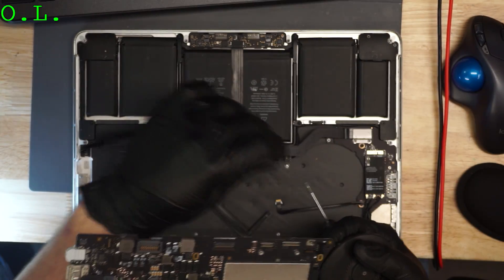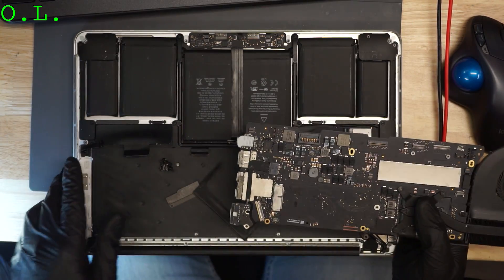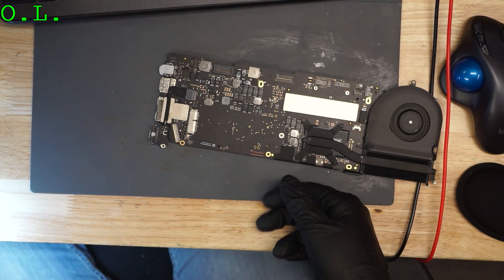So now we're going to take the board out of the case and try to figure out why we have 88 ohms to ground, which is what would be causing us to have no backlight. We're going to be looking for something along the backlight rail that's shorting our backlight rail to ground. Let's see what we can find as we look over this MacBook.